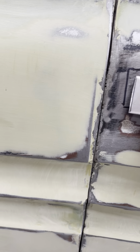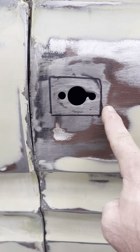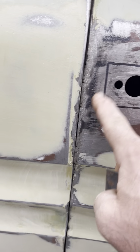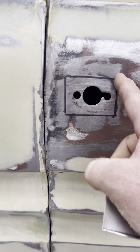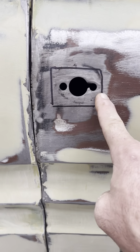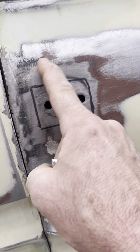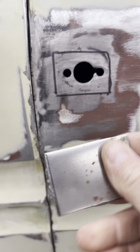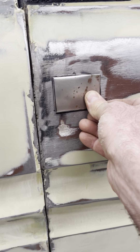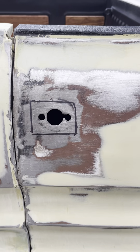What I did want to show you is this is square cuts. I've tried different things where you make an angle, but with a die grinder it's much easier to do patches with sharp 90-degree corners than trying to cut a perfect curve and then get that same curve onto your metal. Over the years I've just decided that my patchwork is going to be squares, and that's made my life a lot easier.